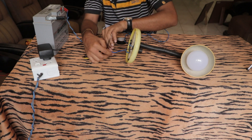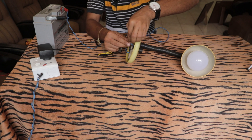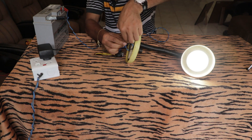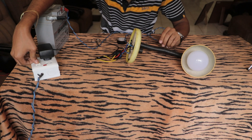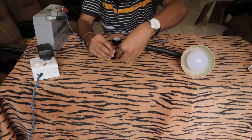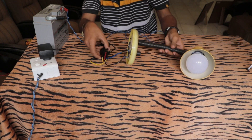Since we're not going to use the red wire, insulate it and close the end so it won't short with other wires in the circuit. You'll be left with the black and blue wires — touch these two together to see whether the bulb is working before insulating the connection. Make sure the wires don't short each other, because then the light will come on even if the relay is switched off. Give power to the main and see whether this light goes off.